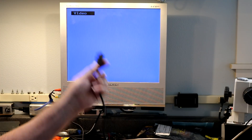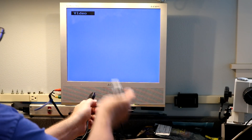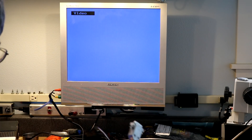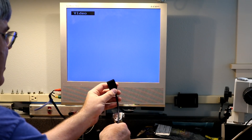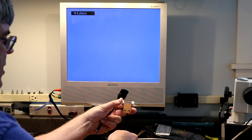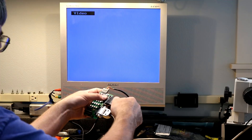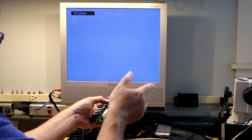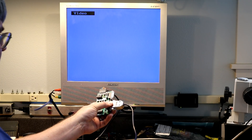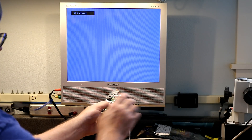So that's the basic demo. Just a note on cabling: I have these extension cables — one end plugs into the 5200, the other end plugs into the adapter. These originally came with plastic ends on them. I cut the plastic end off and put a better quality plug on, because the plastic one plugs in but also falls off really easy. These quality ones are a bit extra work to crimp on, but they will actually stay plugged in, which is nice. They even have little screws if you want to tighten them up.